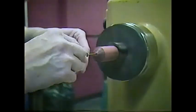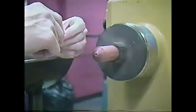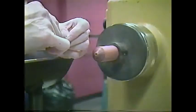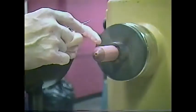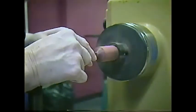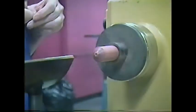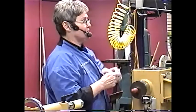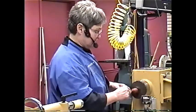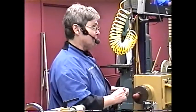And this wood's pretty waxy. And I go ahead and drill the hole the full length of this bit. And the reason for that is so I don't have to worry about how long my hook is. And this normally leaves a little bitty hole clear out on the tenon. So if I do feel like the hook isn't going to hold, or if it's a heavier ornament that I'm making, I can put some glue on the inside and it runs into the hook from the inside too.